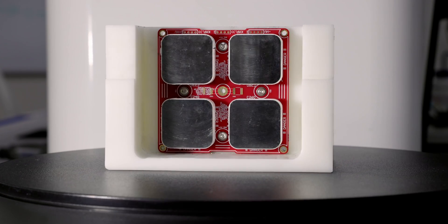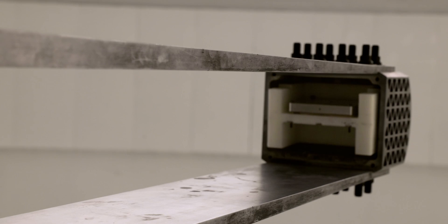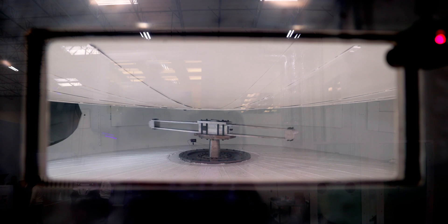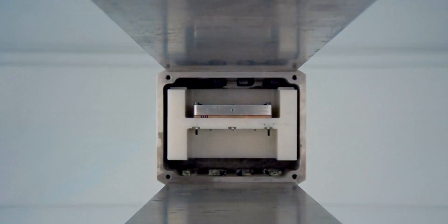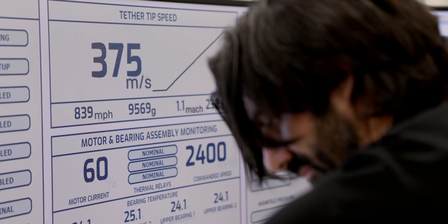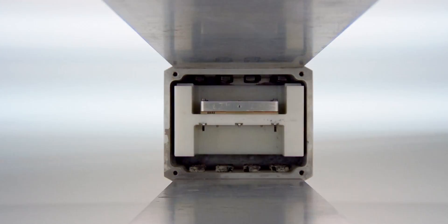Through an iterative process, we increased the epoxy adhesive within the system to underfill the capacitors, increased the board thickness, and made a few other small fixes. Through that process we were able to achieve the 10,000 g environment. When you first hear that number it sounds insane, but once you delve into that analysis and start crunching the numbers and thinking about how things are going to move under that loading, you realize it is an achievement. It didn't take too much to adapt the design to achieve the 10,000 g improvement.